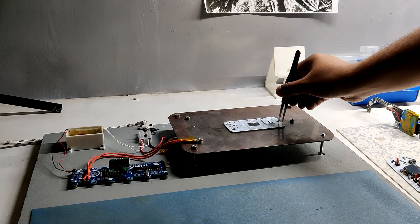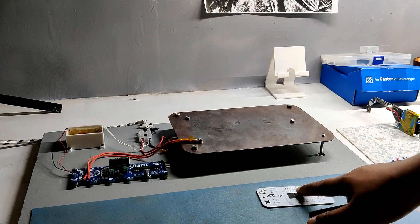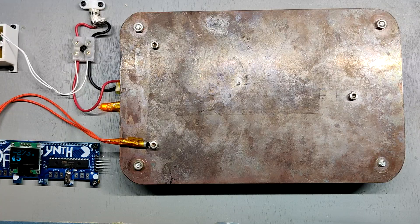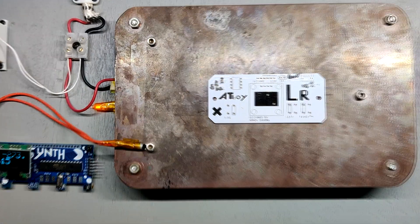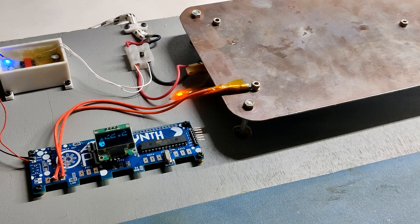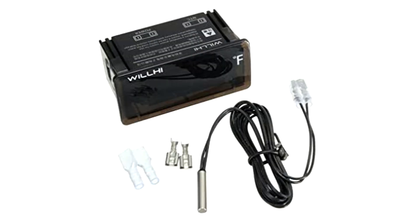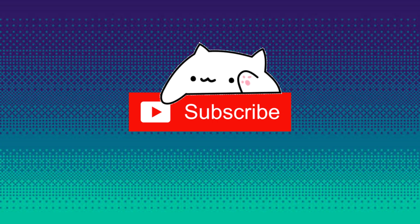The hot plate actually works and is usable for reflowing PCBs. It can even reach up to 300 degrees Celsius, which can be used to reflow even metal core PCBs. Overall I'm happy with this result. However, the temperature sensor didn't seem to work properly once the hot plate reached 270 degrees Celsius — this might be because I'm using a 10K NTC, when a 100K NTC should be used. The hot plate currently needs a more reliable temperature sensor. If the DIY sensor won't work properly, a panel temperature sensor module costing around $15–20 can be used which displays accurate temperature readings. I will make necessary changes and release a part 2. Leave a comment if you need help, hit subscribe, and I'll see you in the next video. Peace out.